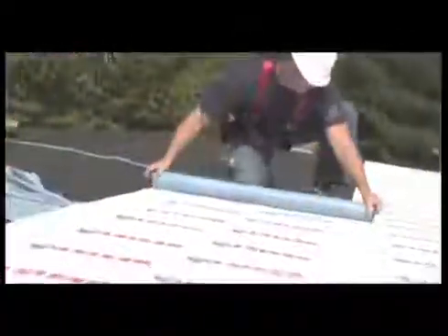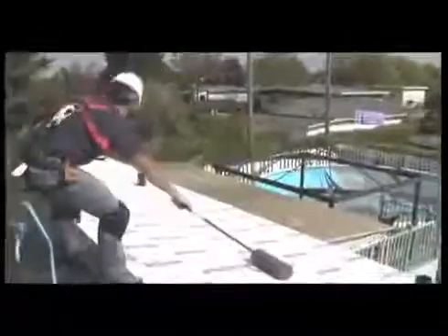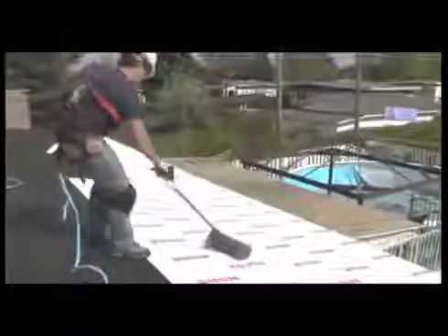If it's possible to pull the fascia back, fold the membrane beneath it. Partially unroll the base sheet membrane and peel back a few inches of protective film to allow it to stick to the surface, passing your hand over it to promote adherence. As your helper maintains alignment of the unrolled membrane, slowly peel back the protective film toward the top of the roof at an angle of about 45 degrees. Smooth with your hand from the center to the edges to remove bubbles, folds and gaps as you go along. To guarantee perfect adherence, run a linoleum roller over the entire surface, and use a small roller on the overlaps with good pressure. Repeat for each length of membrane until you reach the ridge on both sides of the roof.